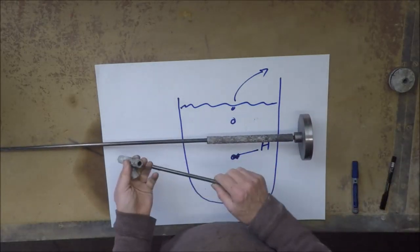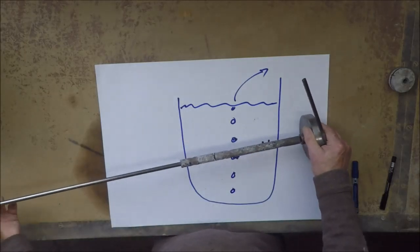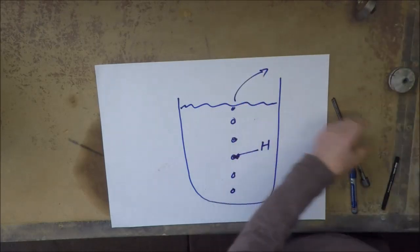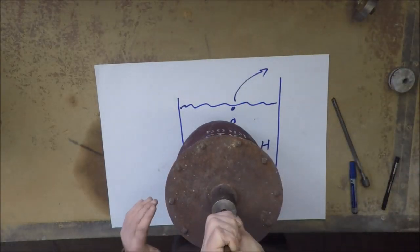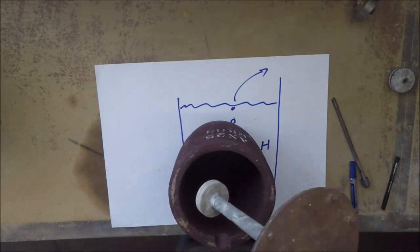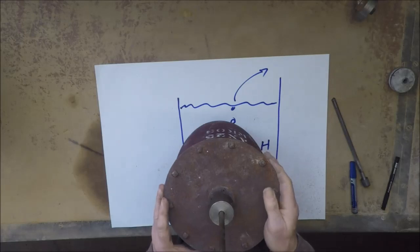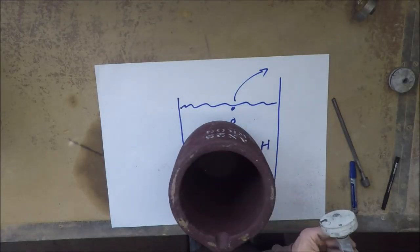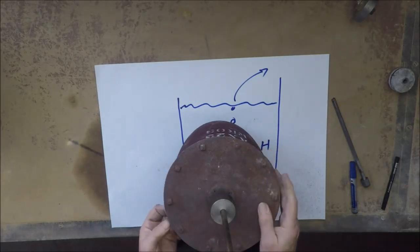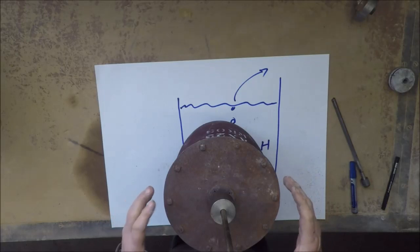The tubes are just mild steel, drilled with a gun drill. Unfortunately I don't have a gun drill long enough to make this in one piece, which would be nice, because the aluminium gets in the gaps sometimes. Here's the smaller version I use for a smaller crucible — this is the complete device. It has a graphite sheath, which is much better. There's a cover that fits loosely on top of the crucible, and a weight sits on top of the graphite sleeve to stop it floating in the aluminium. The cover keeps the atmosphere above the metal mainly argon, preventing moisture from the furnace atmosphere getting at the metal.